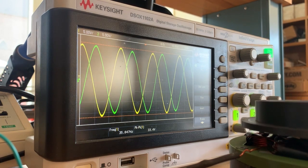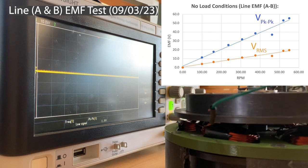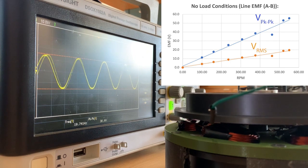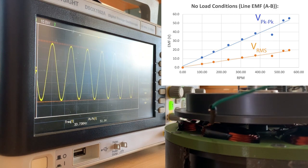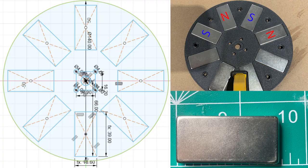Formerly meant to be a BLDC motor, this evolved into what is known as an axial flux alternator. This type of electromechanical conversion machine is best described as a low-speed pancake generator, as it produces surprisingly high amounts of no-load voltage with relatively low RPM, and it is flat like a pancake.